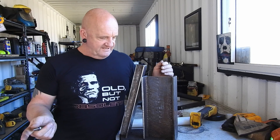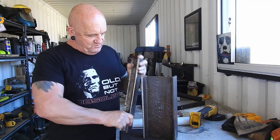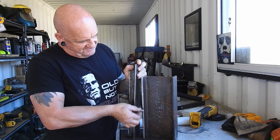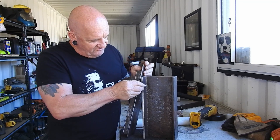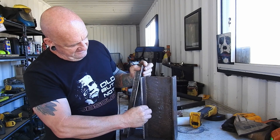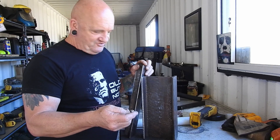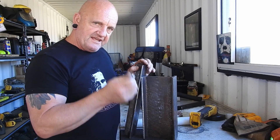Let's have a look at what I reckon is a good idea. I'll try and explain this better. Here's what we already know: we're going to have the plastic in there as lubrication. But the problem is movement this way and that way. What I was going to do was use bearings and have them run up and down here, mounted on this, which would fix the sideways movement problem. But I don't think the outside of the bearing should be used for running up and down because you're back to metal on metal again, which is what we're trying to avoid. So I had a bit of a think about it and came up with another idea.